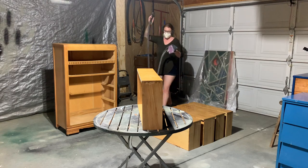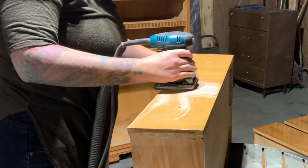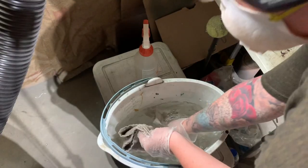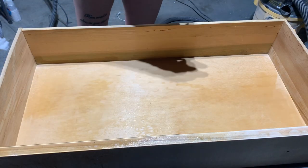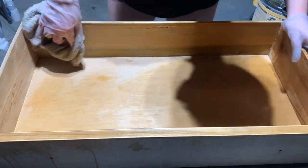Next I'm going to pull out my trusty Makita finishing sander and load it up with 150 grit sandpaper. For my design I'm going to paint the entire box a custom color as well as the top two drawers. The bottom three drawers with the vertical detailing are going to be exposed and are going to have two-toned staining. I first start by scuff sanding all the areas that are going to be painted, just to rough up the surface a little bit and make it better for the paint to adhere to.